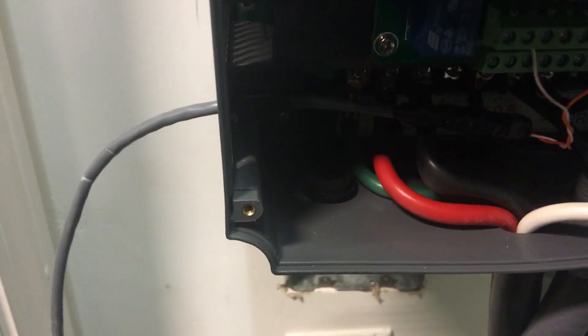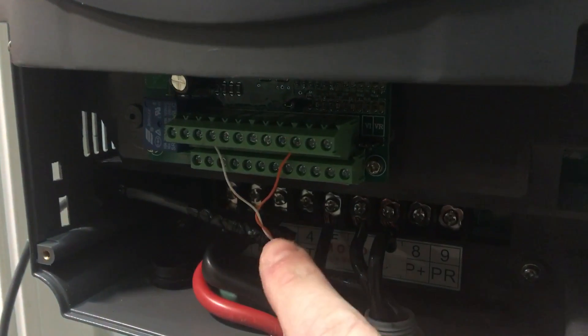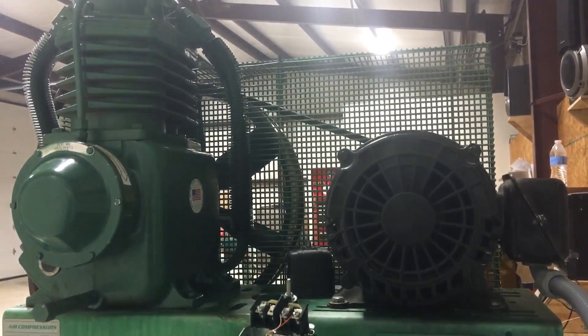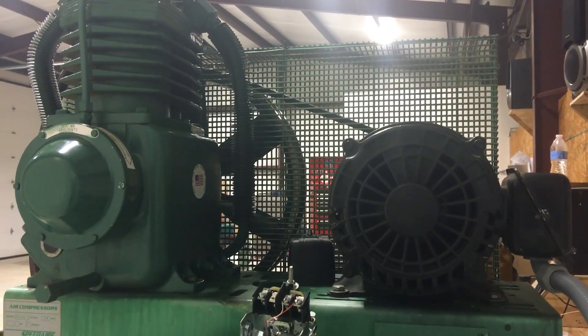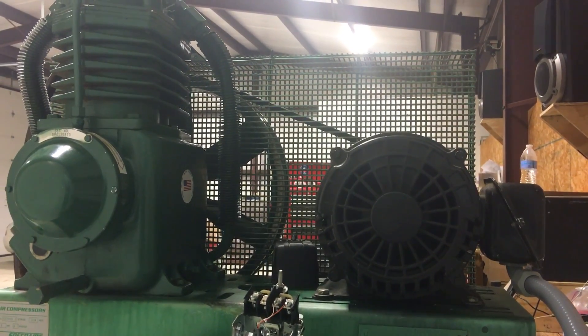But it does work for now, so I can get it cleaned up in a better way. Anyway, just to show you how I have it wired up: basically I'm using the pressure switch to tell the VFD when to turn the motor on and off. I have reverse locked out because obviously I don't want to run these in reverse — they're not going to cool very well and may have issues lubricating themselves.